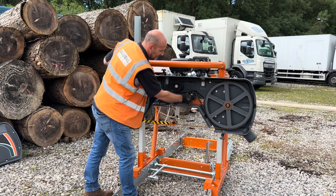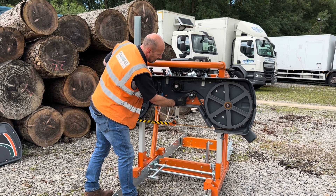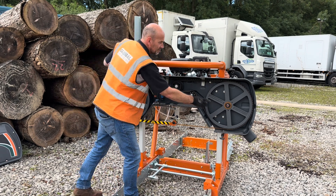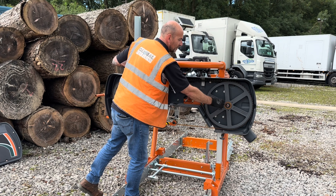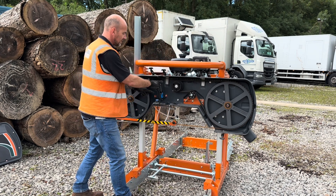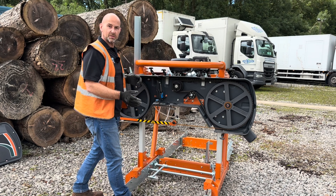We also have another belt on the idler wheel which provides grip for the blade. Belt tension on your main drive belt is a simple adjustment — just slack off the nut, turn the bolt, and that puts more tension on the drive belt. Bearings on these band wheels are needle roller bearings, and these are greased every day: pump the grease into the grease point until you see it purging out near the brass washer.